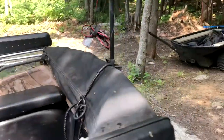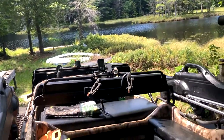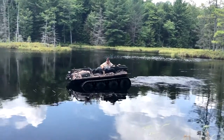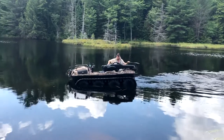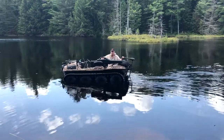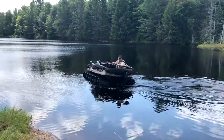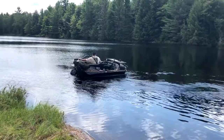First I'm going to try the bilge pump thrusters and see what kind of propulsion I get out of that. I know that this Minn Kota will push this machine with the tracks on it. So I'm going to drop this thing in the water and drive out on the rock. The trolling motor is working a little bit better than the boosters or thrusters. Once I set this up with the actuators, I'll have steering control and get the elbow lifted, because that's the big problem — coming out of the lake.